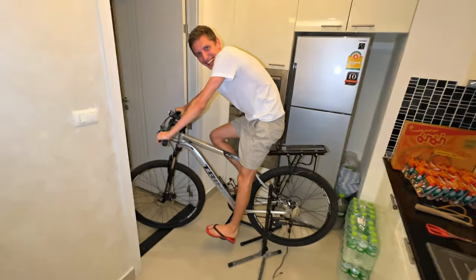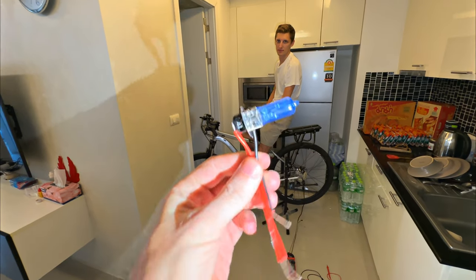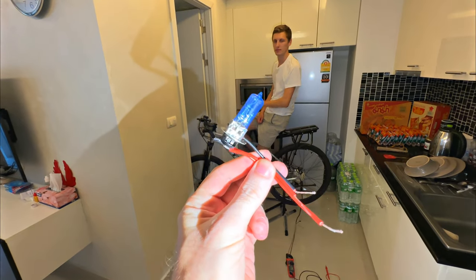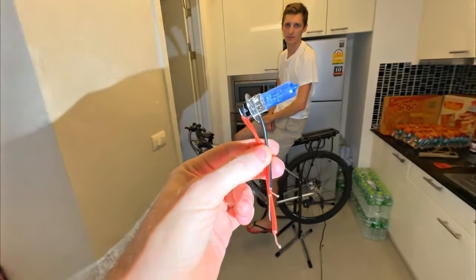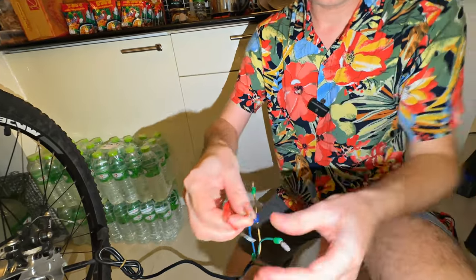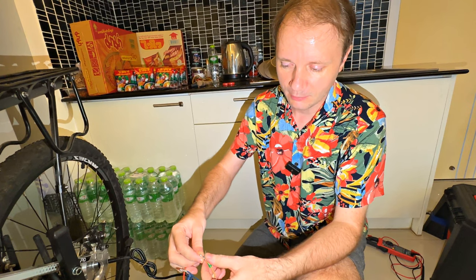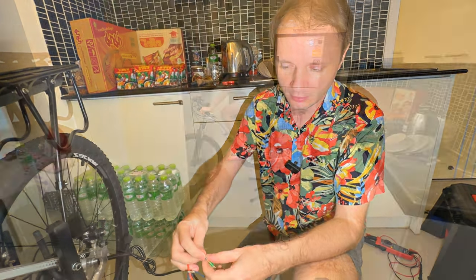In short circuit mode, this motor really works like a siren. Let's connect a regular high and low beam car bulb and see how it burns. A 12-volt lamp with two coils of approximately 50 watts each. We connect it directly to all three phases in order to use the motor power to the maximum. In total, the lamp gives about 100 watts at normal voltage — if the voltage is higher, it will take even more.